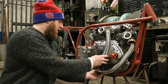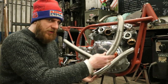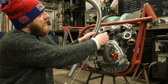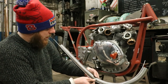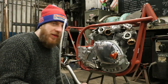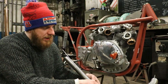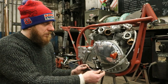Once I've got these two going, the next step is to copy the front pipe with a piece of wire. I'll use that wire pattern to sand-bend the actual pipe. I've got a couple of pipes over there full of sand - I put them in the vice, get the blowtorch out, and start putting the bend in using the wire pattern on top of it. If I copy the wire pattern right, I'll end up with the shape made in solid tube.